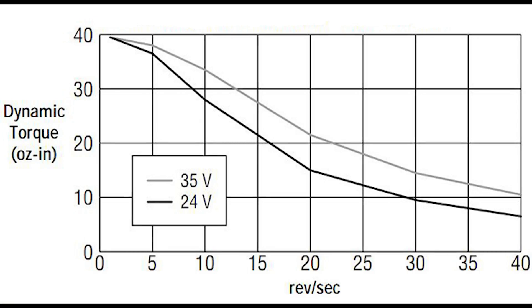If you look at the torque curve of the stepper motor, the higher the speed, the lower the amount of torque it has at that speed. So therefore, if you're retracting at a fast speed of 40 millimeters per second, then you want to try to prime at maybe around 25 millimeters per second.